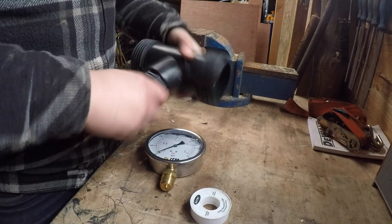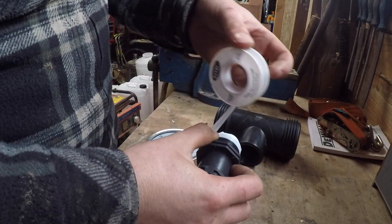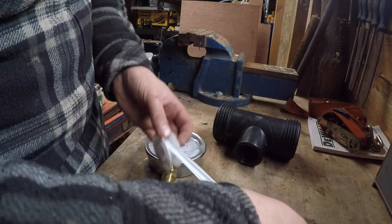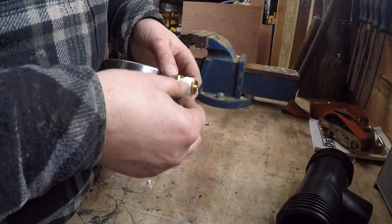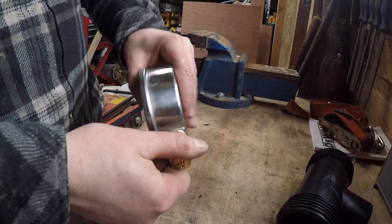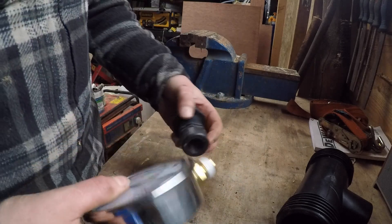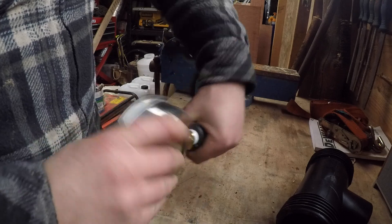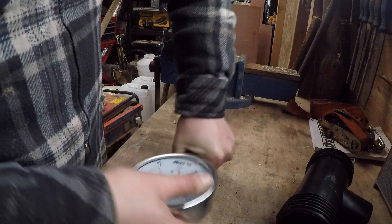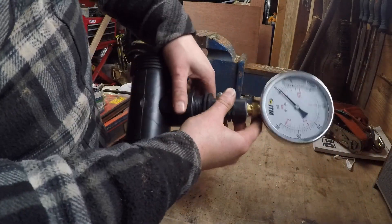So I'm just going to get all these PTFE'd up in the shed here, get them all nice and sealed and put that back on the turbine. I've always struggled with figuring out which way around this stuff goes on — never seem to get it to work nice. There we go, that's better. Get that screwed in there. Tapered threads anyway, so it should bite. I'm going to tighten that down and get this connected up, then we'll have a nice pressure gauge.